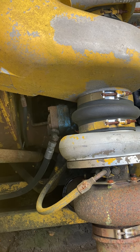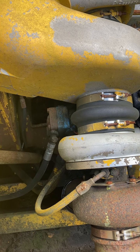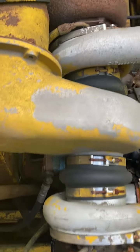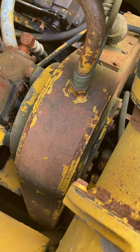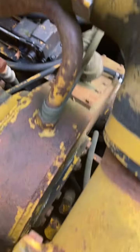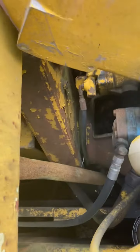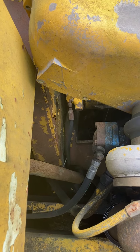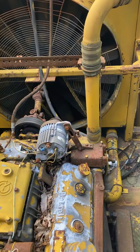It's always on the motor, so when the motor is running it's running. The air compressor is run by the draw works — pardon me, a power divider — and all your pumps are off of that. The through shaft goes from the engine through the power divider into the air compressor; that's how you get power through that one shaft.